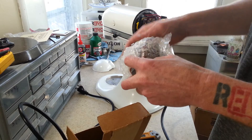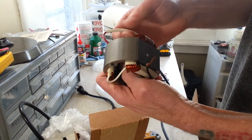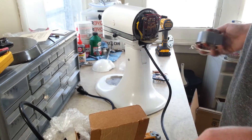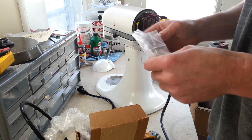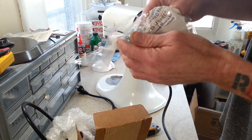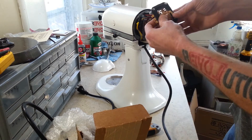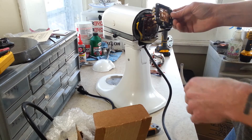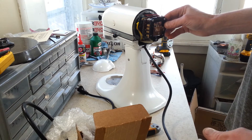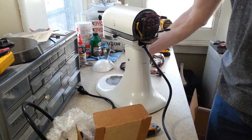We've got a new K45 SS field coil assembly with all our leads and connections on it, and a connection for the brush holders. We've also got a new phase board with all our connections on it. The part that they had bought was wrong for the K45, but it's the right part we need to make this into a solid state control. So we're going to start disassembly and get everything out and put in the parts we need.